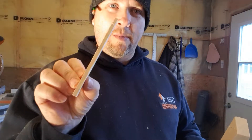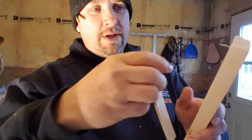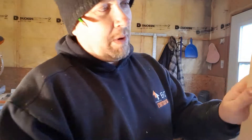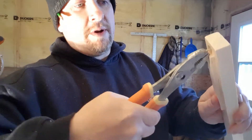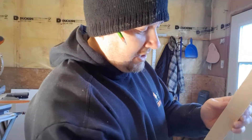So what I do: just take a scrap piece of wood — it doesn't matter what thickness or size it is. Place it by the nail like this. When you use your pliers, clamp them onto the nail and pry on the scrap piece of wood. So now when you pry the nail all the way out, see how the nail comes out — no dent, no mark.